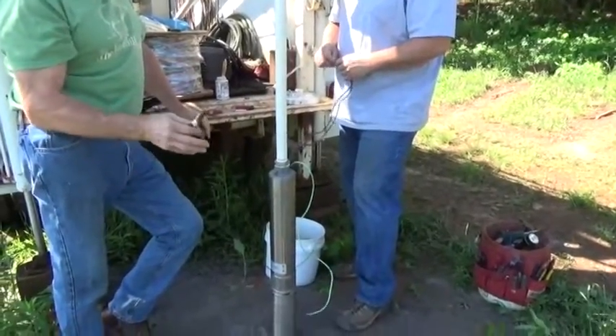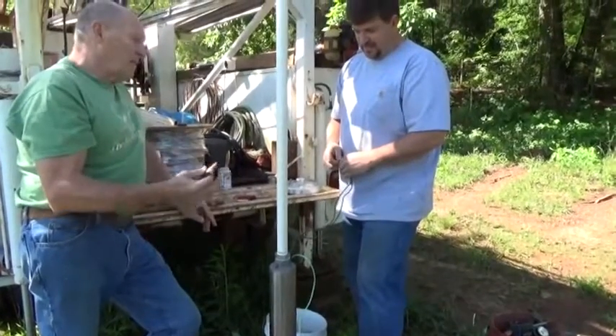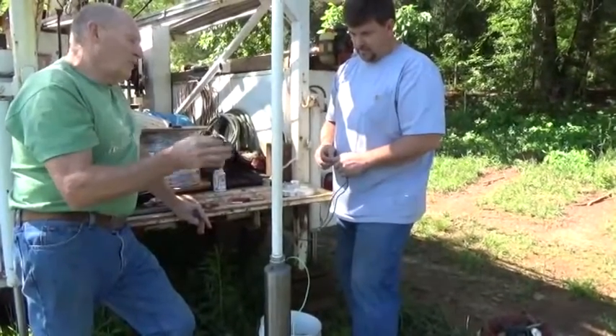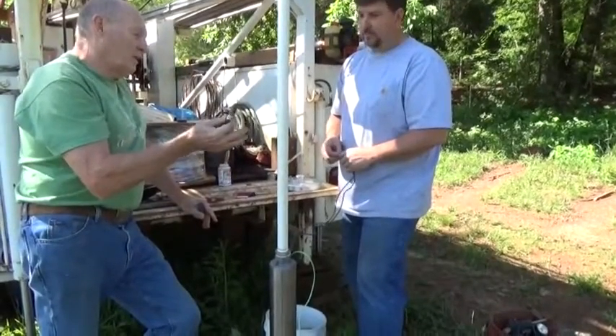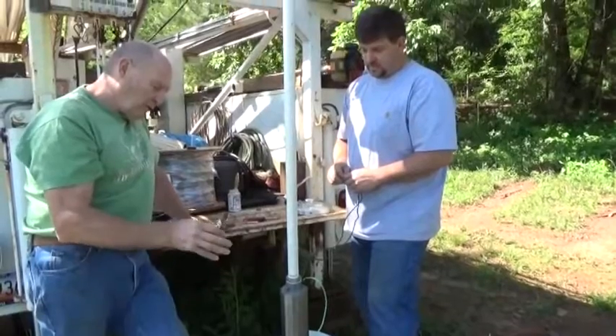You can't be colorblind with the wiring — black, red, and people sometimes hook them up backwards. On a three-phase system, if you've got the rotation wrong you just switch any two wires. But all these residential installs are single phase, and they're going to have four wires.